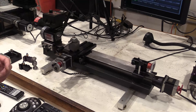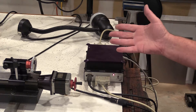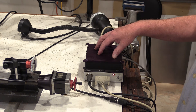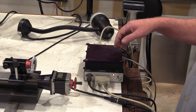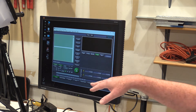To control this lathe I'm still using the original Sherline controller — and here's the parallel port attachment I was talking about. New computers don't have parallel ports, so I bought a box for a couple hundred dollars that takes the Ethernet output from your machine, converts it to parallel, and sends it right into this box. It's totally transparent — you don't do anything with it except plug it in, but it future-proofs things because Ethernet will be around for a while. Just like the mill, I use Mach3 on the lathe through its own separate computer.